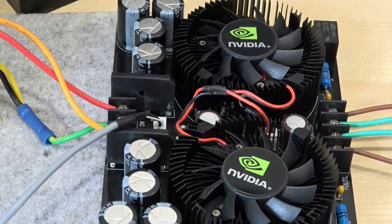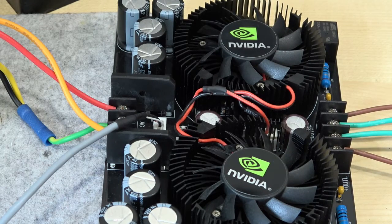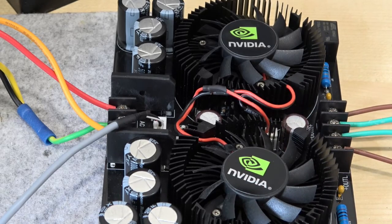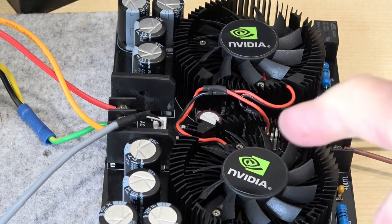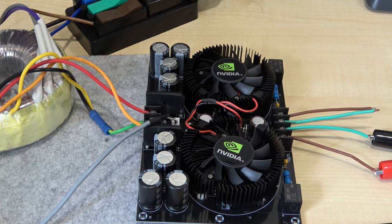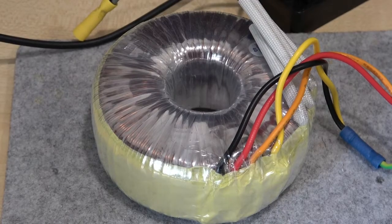The only difference with this version out of the box is that the fans are wired in series. There's a reason for this which I'll go into later - you don't need 12 volts on each fan, it just makes a lot of noise and quite a lot of draft, and it's completely unnecessary. In music use these fans never even get warm - you can just feel a very slight warmth to the heatsink. But sine waves draw a lot of current, particularly into four ohms, so I should keep these tests fairly brief.